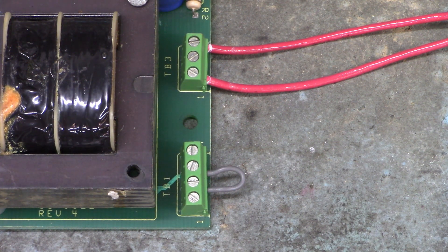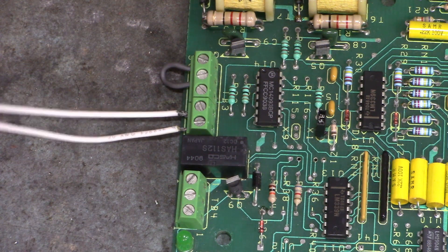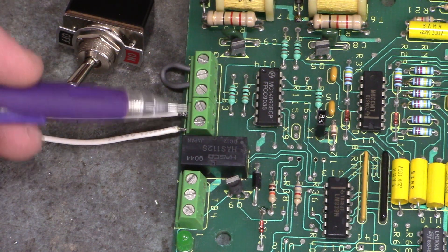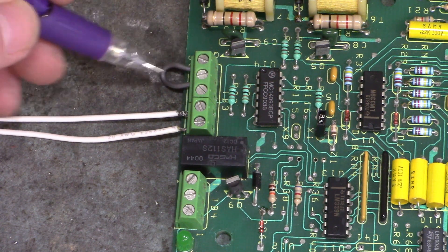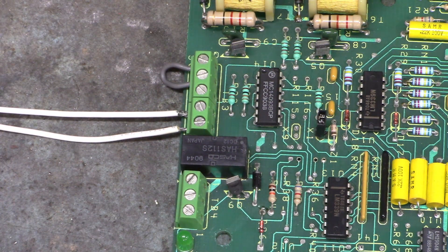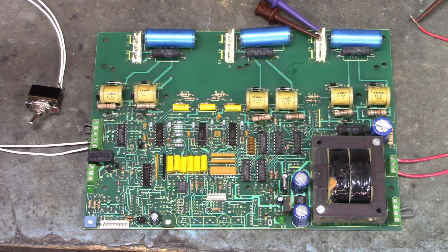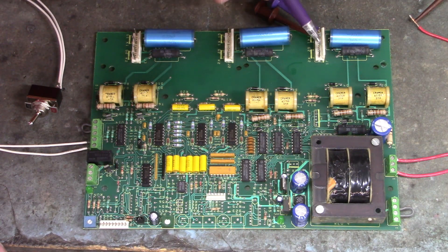If you jump terminals 2 and 3 together, as we have here, that's set for 480 volts in. I have 380 coming in and that's enough — it'll power up with 380. To start the soft start, I have an on/off switch going to terminals 1 and 2, with terminals 4 and 5 jumped together. That's all you need to start and stop it. Here are the six gate cathode connections and right now I'm on J1.